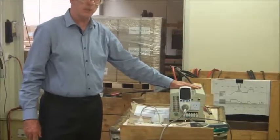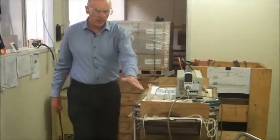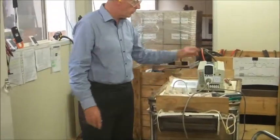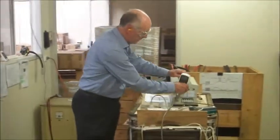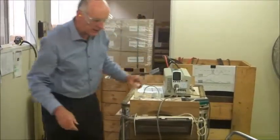The inverter is going to change the power to AC and then the AC is going to run the saw. So the power to the saw is coming out of the 240 volt output of the inverter. Here's the power meter, here's the plug. You can actually watch the power here as I'm running the saw.